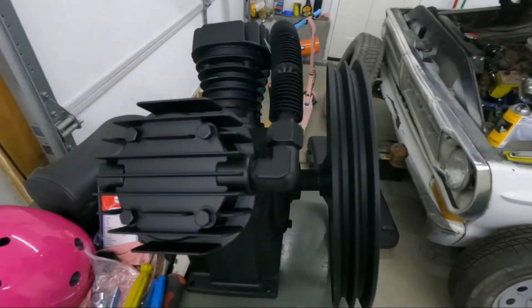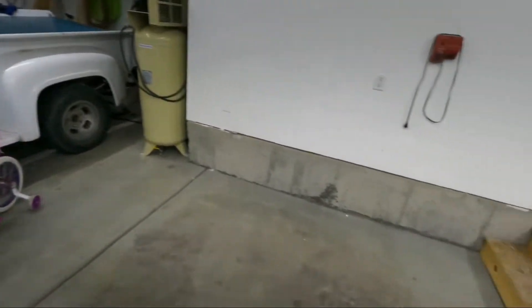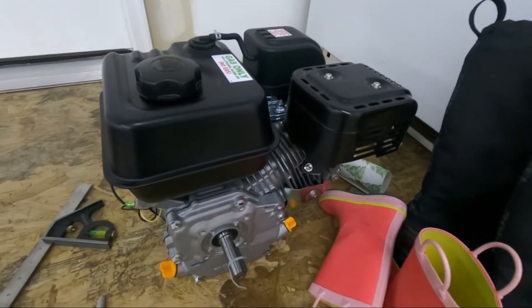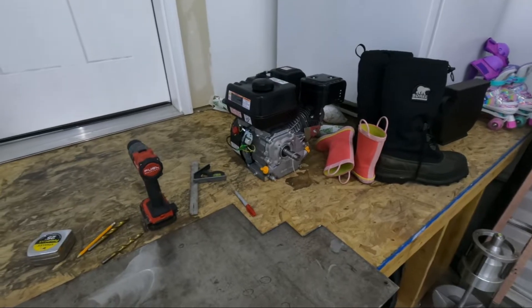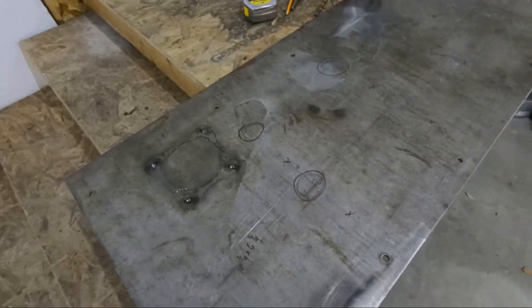Here's my pump - something like 17 cubic feet a minute at 40 psi, I think it's 15-something cubic feet a minute at 90 psi. This is my engine - it's a six horsepower, might be a five and a half horsepower Predator engine. It's 212 cubic centimeters.